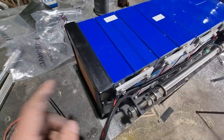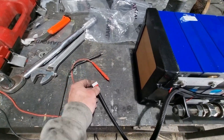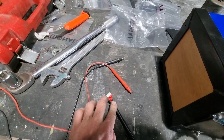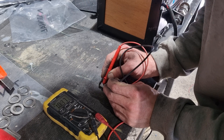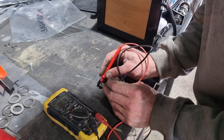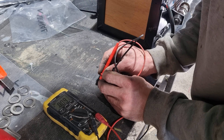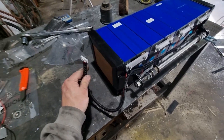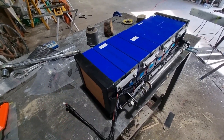I've got the wiring harness hooked up. Now I'm going to go through with my multimeter and test each pin of this plug - put the negative on the negative and then go all the way down the line. As I go from start to finish it should multiply by voltages of about 3, and that'll tell me each wire is connected to the correct cell. If you hook one wire up to the wrong cell and plug this in it will destroy your BMS. Readings: 3.4, 6.9, 10.3, 13.8, 17.2, 20.6, 24.1, and 27.5. Each wire is on the correct cell.